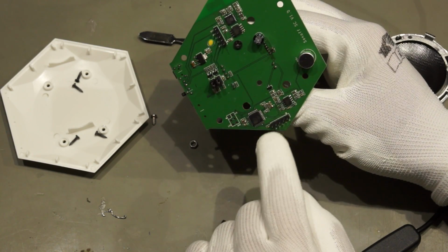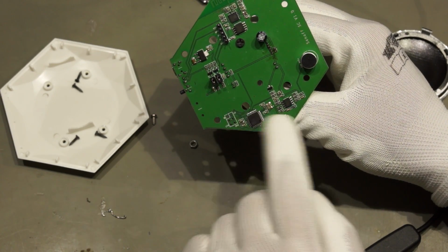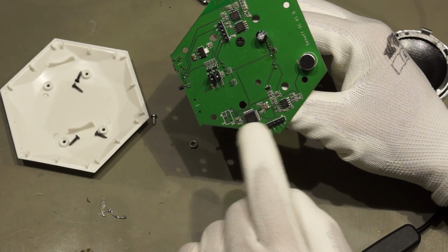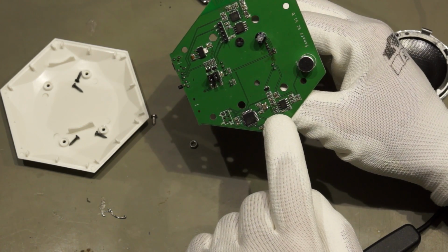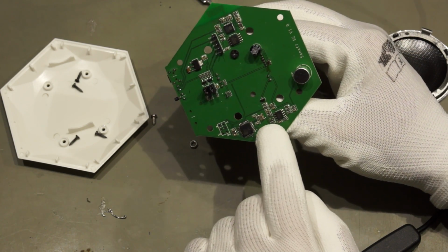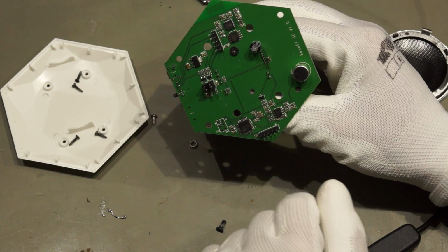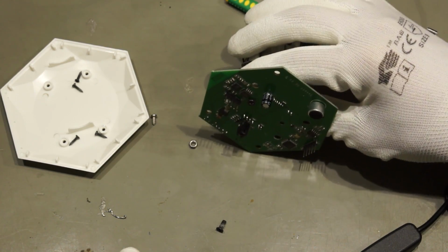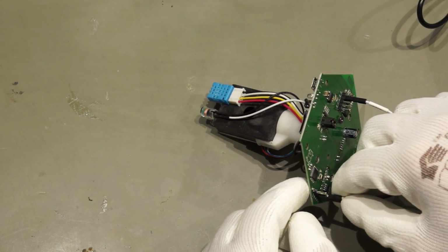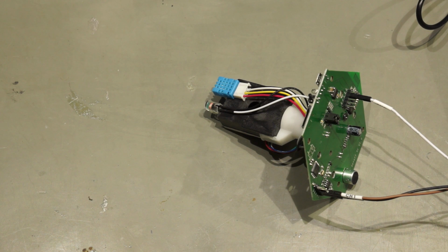And how do we check communication? We can do it either with an oscilloscope, but we already know it's 5 volt. So we have a better tool, and guys who saw my video about making the invisible visible know that the logic analyzer is the right device to work with this communication. So I will connect the logic analyzer to these two pins, and let's have a look how they communicate. I connected now the logic analyzer to ground and to the two channels, to RX and TX, and now we go to the PC and have a look at it.